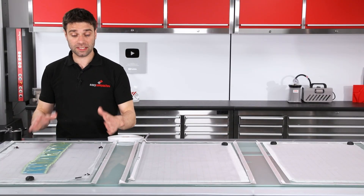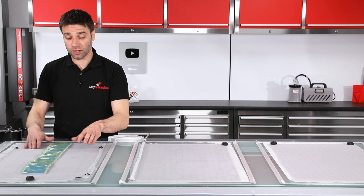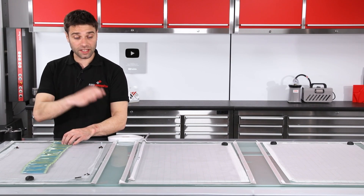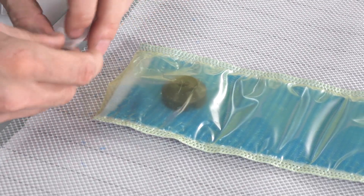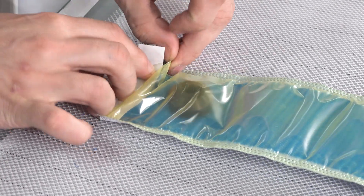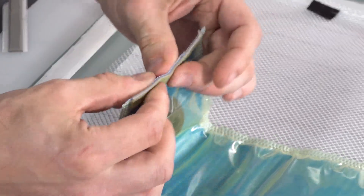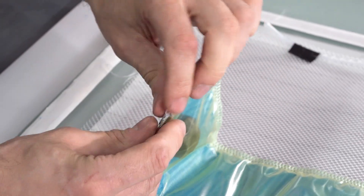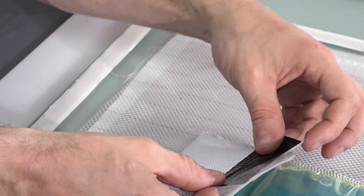The setup for the MVS strip is slightly different. We're running a spiral around the perimeter on this setup, which is quite a conventional way to set up an infusion. To seal and connect the MVS strip to the vacuum, we can place a resin infusion connector on the inside, then seal this using sealant tape placed on the inside of the strip, run it across, remove the backing, and seal the foil down onto it. After doing one side, just take another strip of sealant tape and place it across the back. A belts-and-braces approach is to use some duct tape placed over the top of that as well.